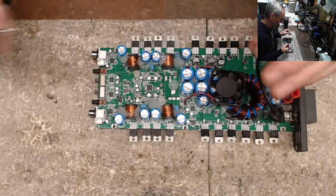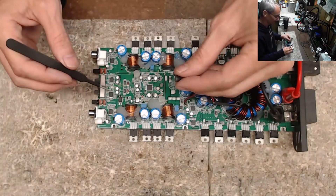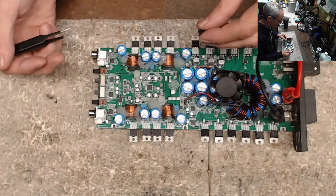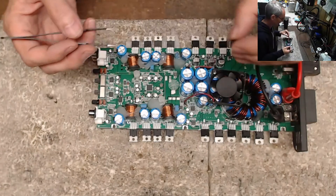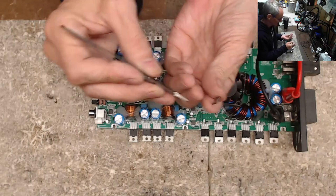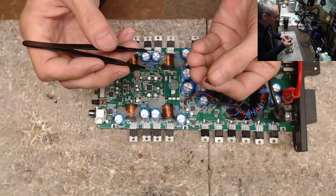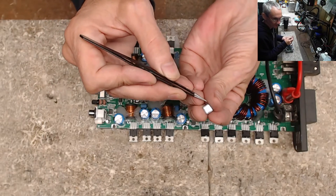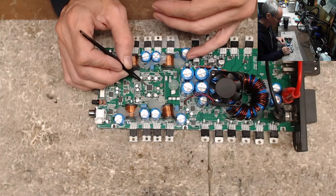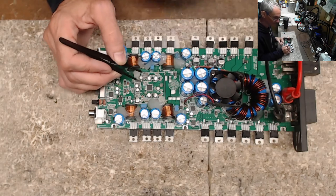If you put too much solder on it, the IC will just bounce around on you. Another approach is to put a little touch of solder in the middle on the board itself, then with plenty of flux, balance the IC on and you'll know when it's hot enough because the IC will actually sit down into place. Pre-tin the connections, pre-tin the ground plane, lots of flux, heat it up, and the thing falls right into place. Nine times out of ten you don't have to go back under the microscope and re-flow the connections.